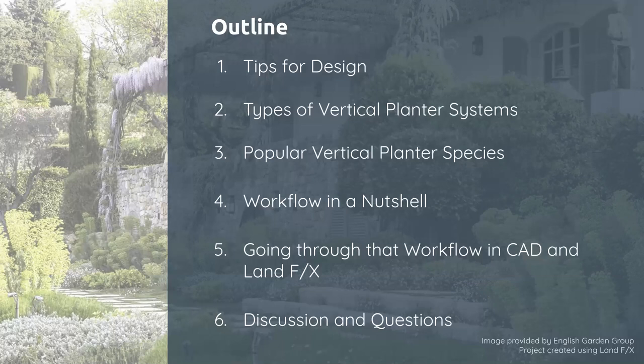I want to say I'm not an expert on every vertical wall system out there — absolutely not. But I am an expert on CAD and LandFX workflows to get it drafted, and that is the main focus today. There really are multiple ways to do a lot of what we're going to cover. This is one suggestion, so if you have 'what if I do this instead' questions, put those in the Q&A box and we can discuss alternative methods at the end. We're going to cover a little bit about design, then focus on how to communicate it so it gets built, and we'll also cover irrigation.